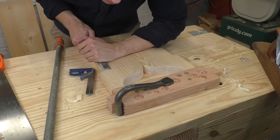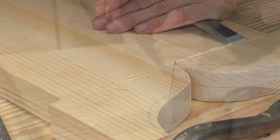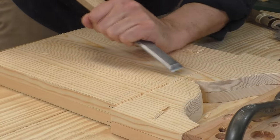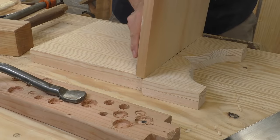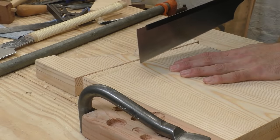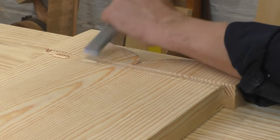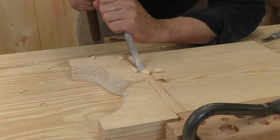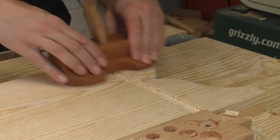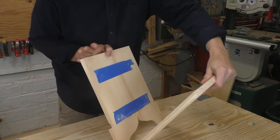Once the notches are cut and cleaned up, I just need to cut the dado that's going to hold the bottom — it's a lot like cutting a rabbet. It starts with a knife and a chisel to make a knife wall, and then you saw the bottom shoulder. Then you can be really aggressive with your chisel and get down almost to full depth. Instead of measuring for my top shoulder, I like to lean the actual stock into the joint and trace it with a knife before I saw it. I'm deliberately making this joint too tight, because it's much easier to adjust the thickness of the bottom than to change the width of the dado. As I remove the waste and trim the joint to final depth, I'm concentrating on crisp lines more than anything else — a sloppy joint line will show forever. Once I pop those sides apart, I'm ready to assemble.